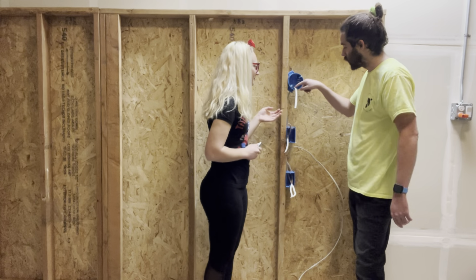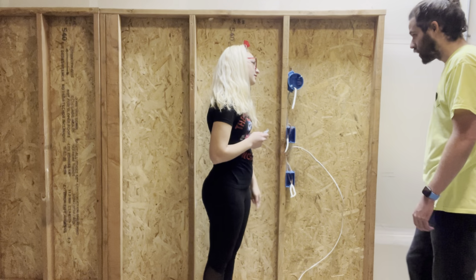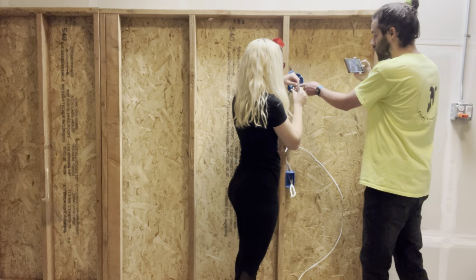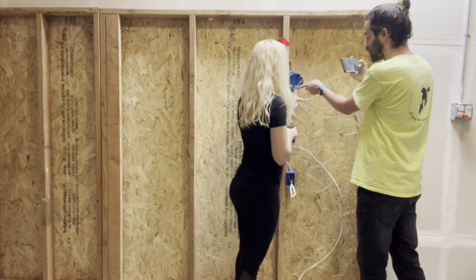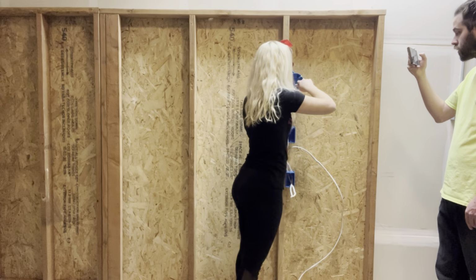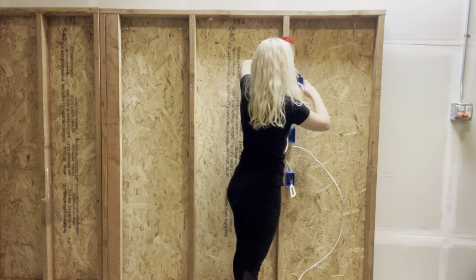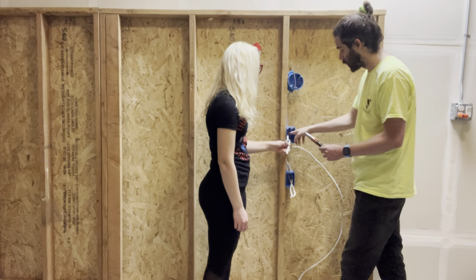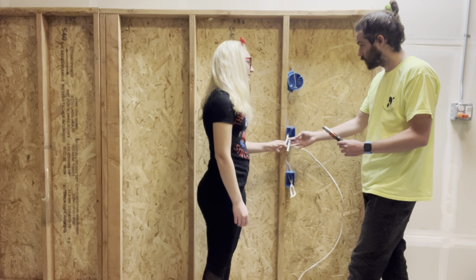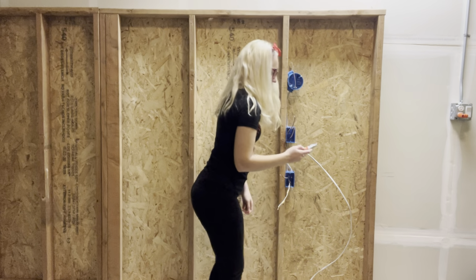I don't want to. So you're going to go ahead and just strip this wire. You can put it right down the middle. Take the razor blade, put it right down the middle, and that'll be on the ground wire. And then, just go to the end. Don't put your hand behind it. And then once you get up to the top, you can just score it again sideways on the front and the back. Just like that too. Okay, nice. And then you can remove the paper from the ground. Yeah, nice. This is like not sharp. Yeah, it's probably old. Alright, so the next thing, do the same thing, just strip these wires out down the middle. Remove the sheathing, and then remove the paper off all four of those. Boom.